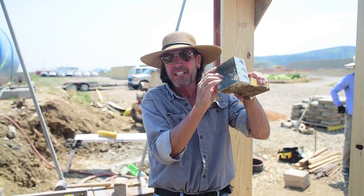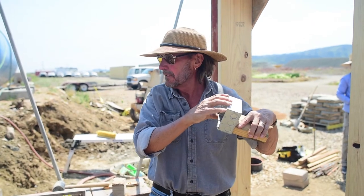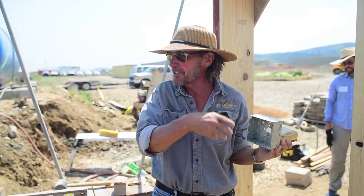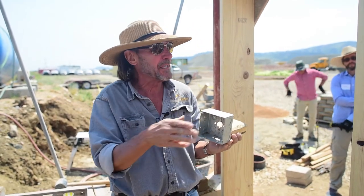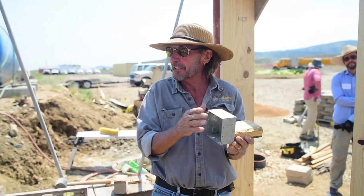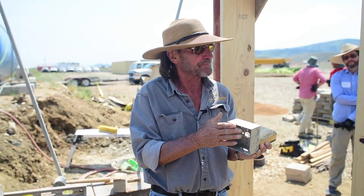You'll see these little screws on the front — those are to attach a plaster ring. Plaster rings come absolutely flat, for instance if you had exposed blocks, and then they come in quarter inch, three-eighths, half inch, five-eighths, three-quarter. You can get different thicknesses, and the thickness you want to buy is the one that matches the thickness of the plaster you're going to apply.